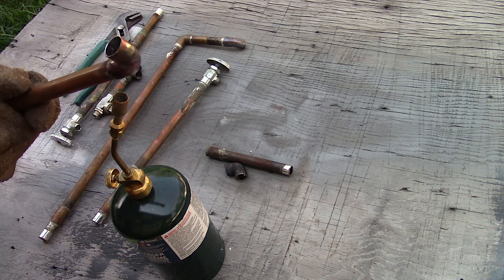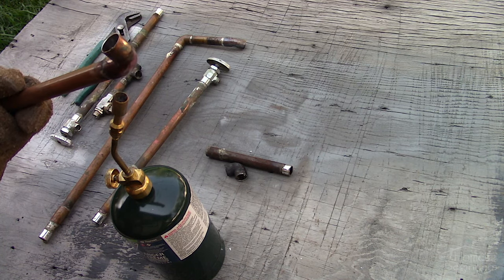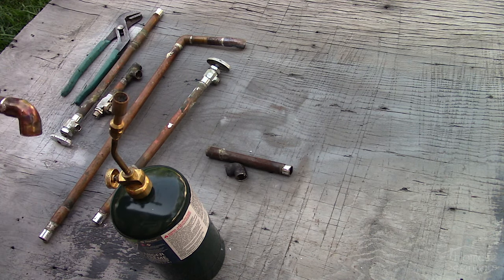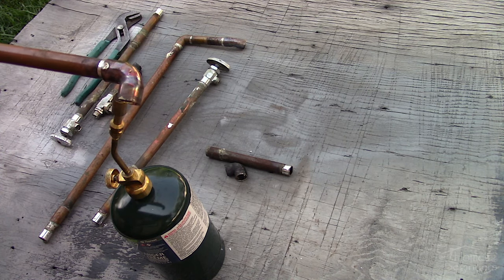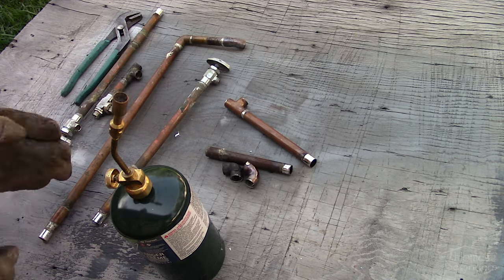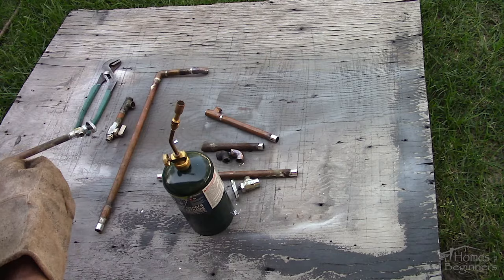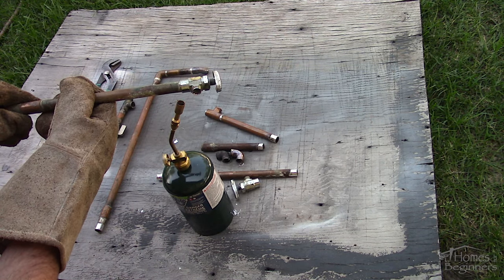The copper pipe will become hot. In order to make it manageable by hand, I'm using leather welding mitts. They won't burn like other styles of gloves and have some resistance to the hot pipe. Once the joint is hot enough, pull the connection apart. You'll need to be quick as the joint can cool off and the gloves are only resistant to heat so much — they won't completely stop heat transfer when holding close to a joint for a longer period of time. The connection may need a couple attempts and a twisting action can also help removal.